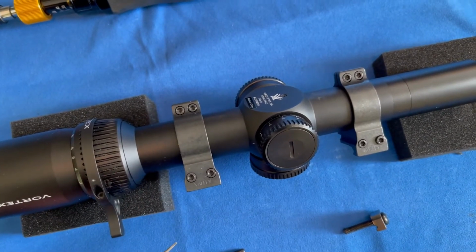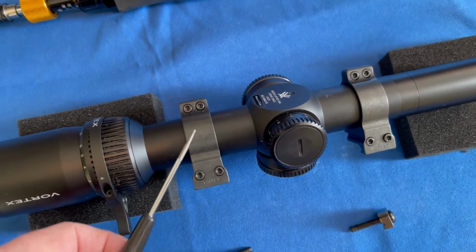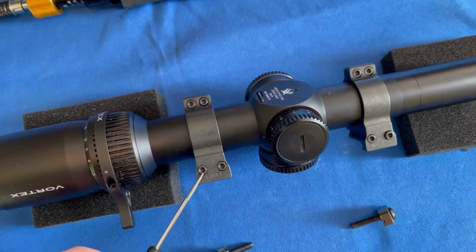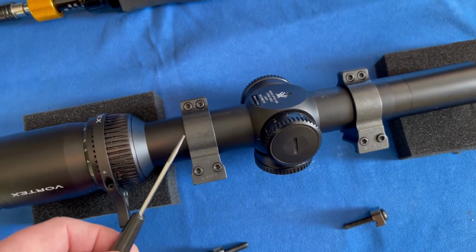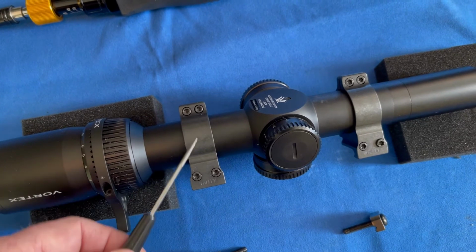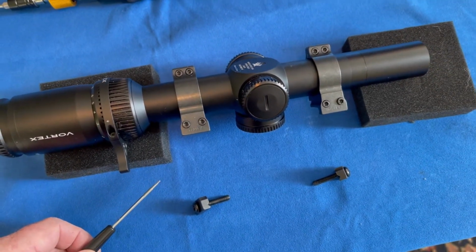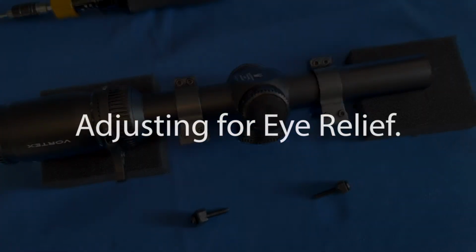And the literature online says in 2017, the literature says that these are 6x48. My calculations make these 8x40. So the call out is 8, and then the threads per inch are 40. And then this is a smaller size and this is a longer size. Just to let you know, do your own research, and if you come up with something different, please leave it down in the comments for me. Thank you.